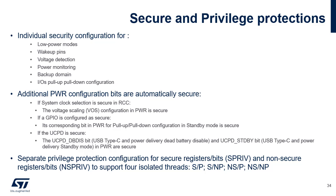The PWR is a TrustZone-aware module. Both the secure attribute and the privilege level of some PWR registers are programmable, enabling four partitions: secure privileged, secure non-privileged, non-secure privileged and non-secure non-privileged. The PWR TrustZone security secures the following features through the security configuration register: low power mode, wake-up WKUP pins, voltage detection and monitoring, VBAT mode and input-output pull-up/pull-down configuration. The security of some features is based on an inheritance mechanism. When the system clock selection is secure in RCC, the voltage scaling VOS configuration and the regulator booster are secure. When a GPIO is configured as secure, its corresponding bit for pull-up/pull-down configuration in standby mode is secure. When UCPD1 is secure in the GTZC, the PWR UCPDR register is secure.